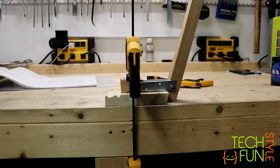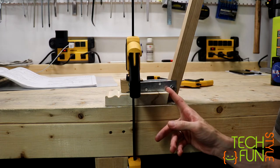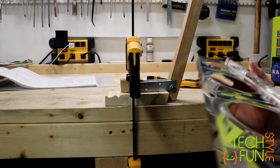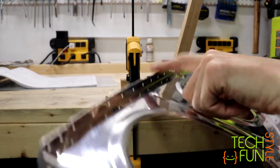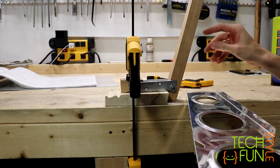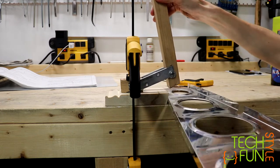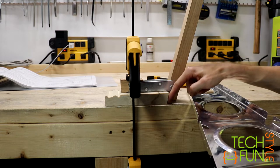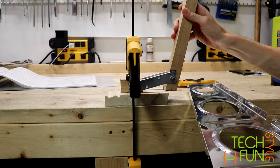So by making such a simple tool, I was able to solve one of my two problems. My first problem, which I was talking about, is the 90 degrees angle of the flanges on my wing ribs. It's a very simple tool. It was shown on the forums, so I didn't invent anything new. As you can see, this is an 11 degrees angle here, so it's basically not straight, but at some angle. Same angle here on the handle.